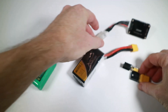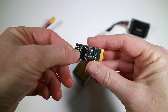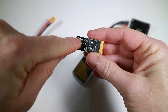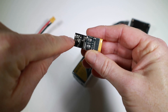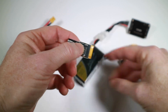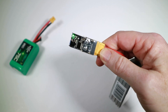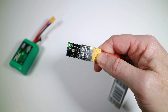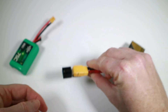Okay, so I'm going to plug these in now. There are some LEDs on here and these should indicate how many cells the battery has: blue lights up for 2S, blue and red for 3S, green on its own for 4S, green and red for 5S, and green and blue for 6S. First off, let's see if it detects the right thing — it says there'll be about five seconds of flashing, and then it will get on with discharging. It's detected green — that's good — and it's going to start discharging as heat.